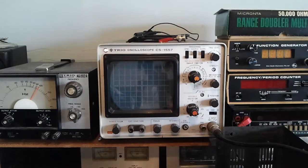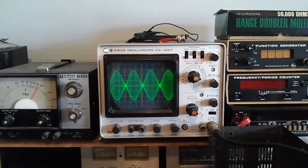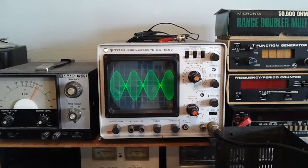So we put it into transmit. We've got it in lower sideband mode, so if I bring up the audio gain, there is our two-tone test signal. I've put a balance control on this two-tone generator to balance the level of the two tones, so regardless of the frequency response of the mic amp and the transceiver and the band pass of the IF, I can get these points crossing over here so that we get the correct looking envelope. So after ensuring that is correct, we bring up the mic gain until we get to the point of distortion — there — so we back it off a little bit and have a look at the RF output meter, and it says 35 watts.